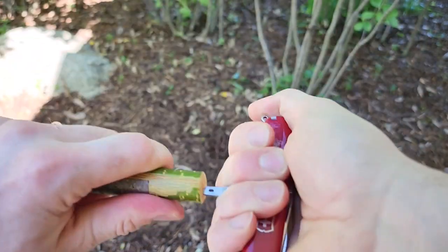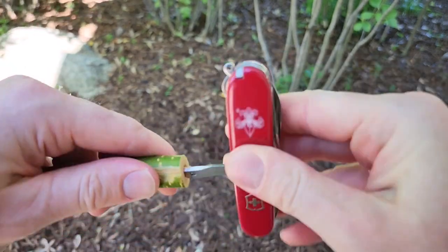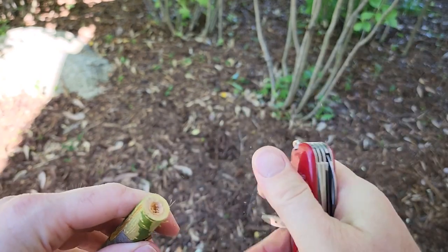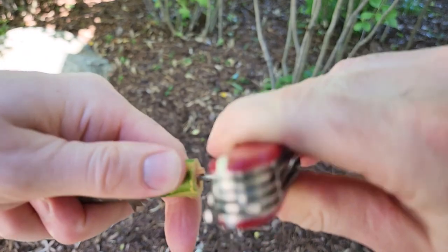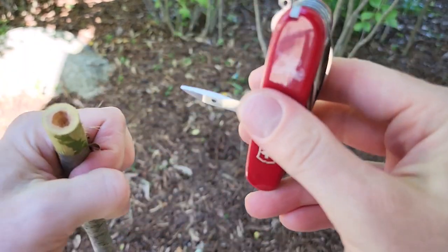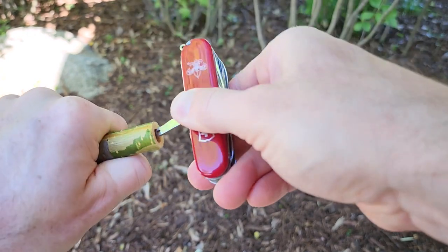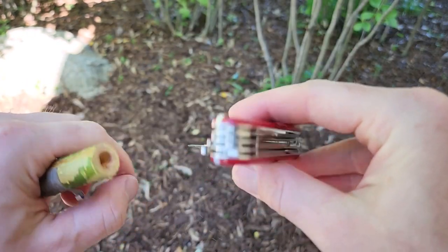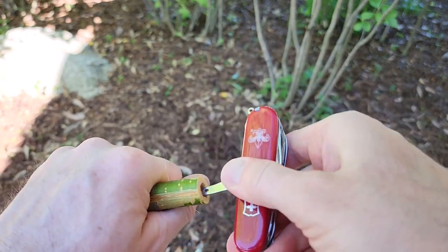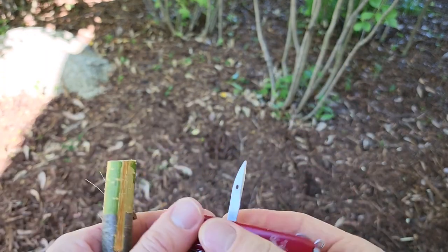If you're finding this rather difficult, it might help to sharpen your awl — it totally helps if you keep an edge on there. These just sharpen on one edge, they're a single bevel tool. We're working towards the center and just making our way down in there. You've got to work with a little bit bigger piece of wood if you're going to be making your own holes, because the smallest hole you can make is the size of the awl. Once you get in there, you can kind of peel the edge off. The way the awl is made, you can ride the bevel along that edge and it'll basically peel wood off. That's a pretty good hole. We're going to have to clean that up from the other side once we get this finished.